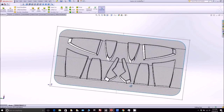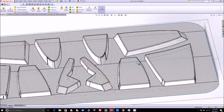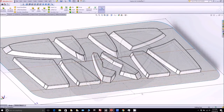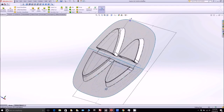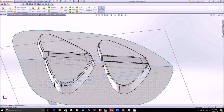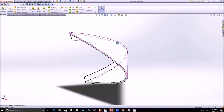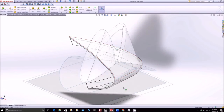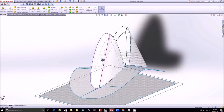Here they are laid up ready to be milled — just a flat flange. They've all been turned on their face with some little fillets added around the corners, laid out nicely so those ones are ready to mill. Here we have the one that goes at the front of the tank and the one on the back attached to the leading edge at the door. I've mirrored it so there's left and right pieces — four pieces in total. Likewise there's the actual part that bonds to the door skin to make up the wing, laid out with left and right as one plug, ready to mill.